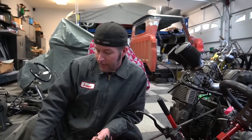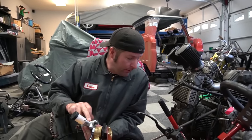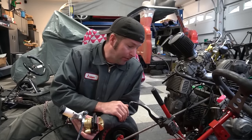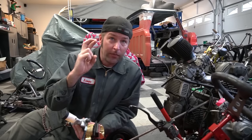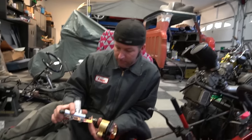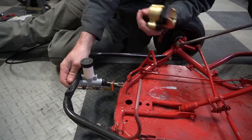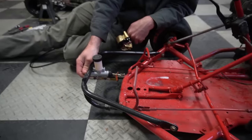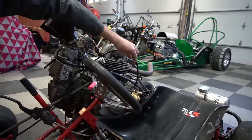Our clutch slave cylinder. That's what it is, a clutch slave cylinder. And I don't know what piston size is inside of this or what's inside of this one. But the housings are the same thickness, so I'm hoping the piston size is the same, because if it's not, we can run into an issue. So you're gonna mount it like there? I'm thinking I would mount it somewhere right here. Okay, and then our pedal is gonna kick that and push in? Yep. And hopefully this line is long enough, and it is, look, boom. Sweet.